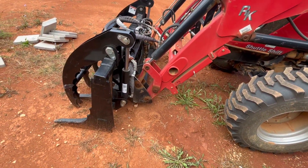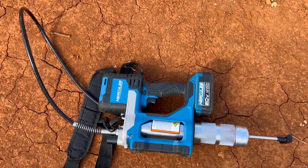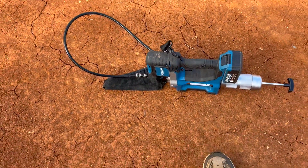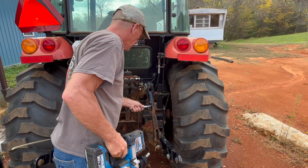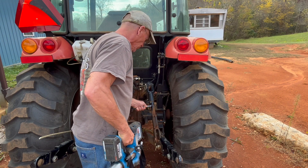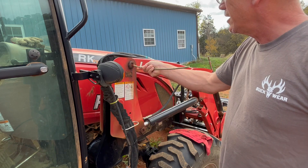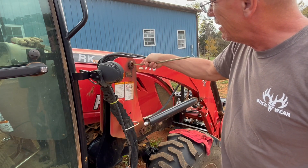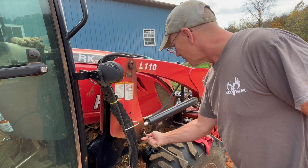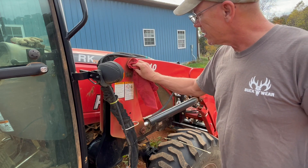Next thing to do is grease this up. I got tired of hand pumping grease — even though I only have one tractor, it's enough for me. I have an electric pump and it definitely saves a lot of effort. A lot of people aren't as particular about this as I am, but I prefer not to be pumping dirt into my grease fittings, so I clean the area out a little bit and give the top of the grease zerk a wipe so it's clean on top.